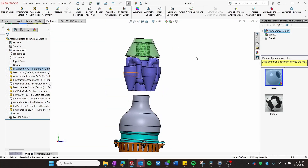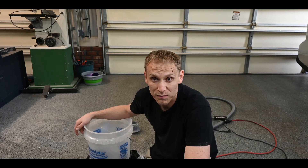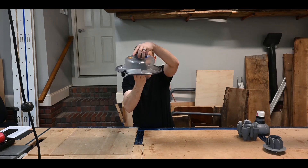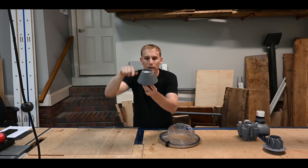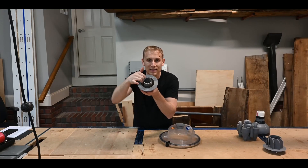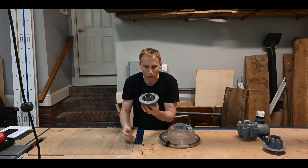The next thing to do is go back to the drawing board and look at some better designs. I think much like the Dyson vacuum cleaners, there's going to need to be a dual stage cyclone where the first stage gets 95–98% of most of that dust out, and then you have smaller cyclones that deal with the fine dust. The first part of the redesign is this piece — it's going to sit in the lid. It's basically a comb where the outside is smooth, so all that dust coming in hopefully goes around the cyclone, and if it does hit this, it doesn't have anywhere to immediately turn inward. That allows a lot more of that dust to lose momentum on the outside of the cyclone and fall down. The air is actually drawn inside the cone on the underneath side, so it takes quite a bit for heavy dust particles to make that turn — really only fine particles make that corner going into the cone.